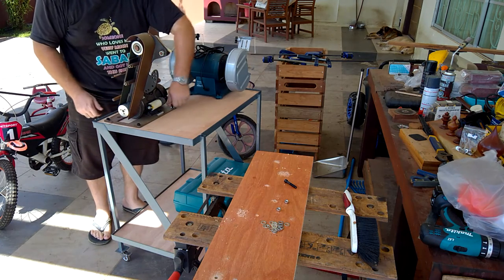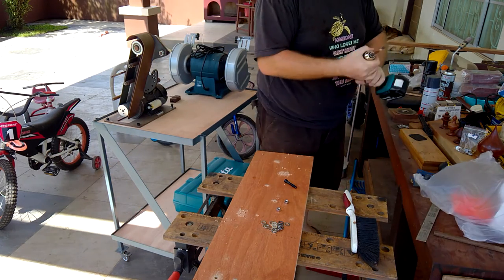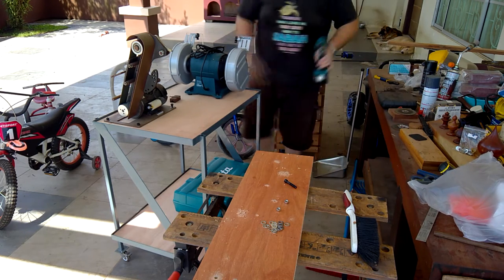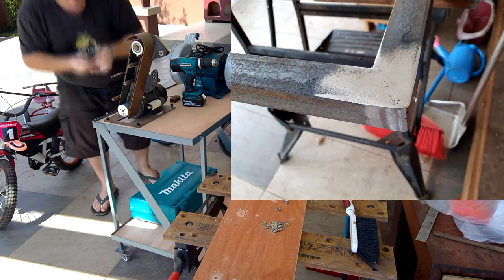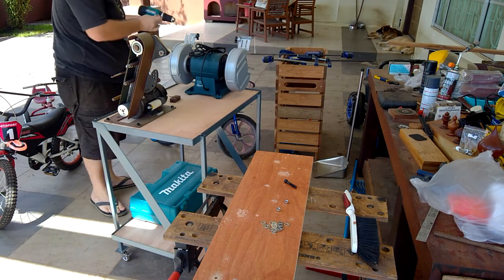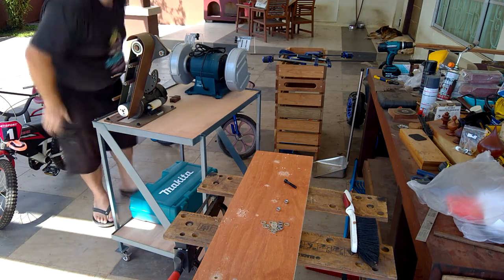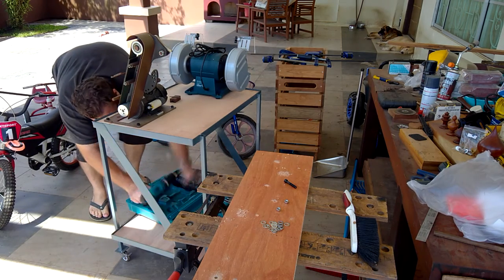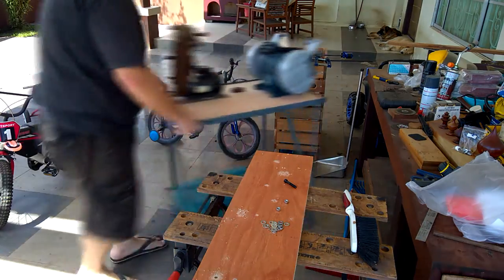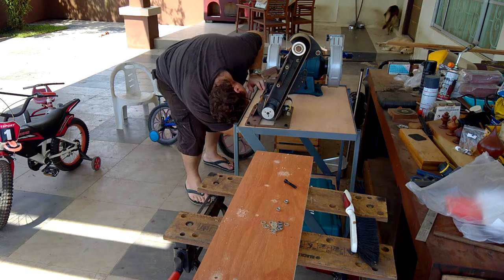The main thing I wanted to bring up is that while wood can be a very unforgiving medium for mistakes, metal was just the opposite. If I didn't get a weld just right I could grind it back and take another pass at it and just keep going until it looked good. I burned through the metal a few times but with persistence I was able to rebuild it, flatten it out again, and make it look perfect. Even if I set an angle wrong when tacking the metal together, you can cut it and tack weld it again. It's a really different experience compared to wood, where if you cut it too short or put a hole in it, it can be quite difficult to cover that up.